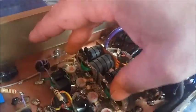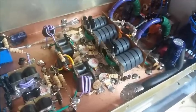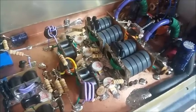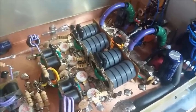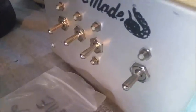All right. The only other thing I didn't do, which I thought about doing, was taking these 500s off, but I understand that metal clads have been kind of scarce lately. They haven't been scarce over here since I've invested in so many of them, and I don't go through them real fast, and the amp's working real good with them. They're definitely strong enough. You got 2 500 volts together, 500 picofarads equaling 1,000. So I just thought I'd leave it on there. So it's good to go. Anyway, here's your switch that was in there. And as you can see, man, I went ahead and upgraded to a heavy-duty switch for all your switches.